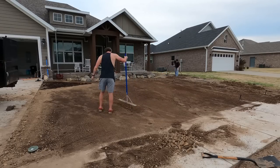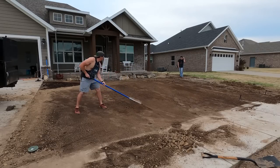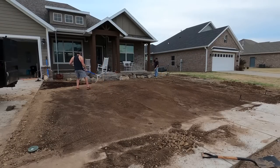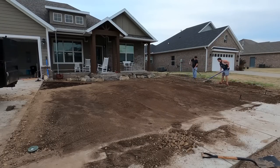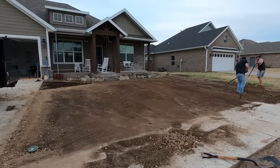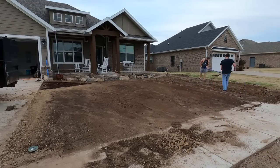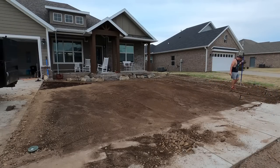I've talked for about a year about wanting to do a french drain in my backyard. I've gone back and forth — right now I've just got a trench and it stays really marshy, which is annoying. What I want to do is dig out that entire edge all the way around my backyard and turn it into a french drain — put two corrugated pipes with holes in gravel, all the way down, and also dig trenches from my downspouts and connect them to that french drain.